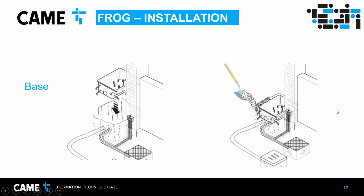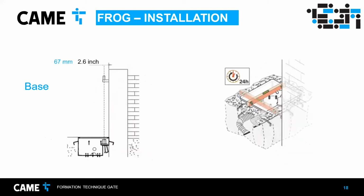So the dirt side, earth absorbs the water. After that, you put the main case and do the concrete around it. Like I said, put it as secure as you can. And the limitation here will be align the hinge of the door to the axis of the operator. It has a little axis where it's going to be. You need to align that as perfect as you can. That's very important to be super level. Some people use a little string with a weight, or a rock, and you can align it perfectly. And that way, yeah, they need to be aligned.